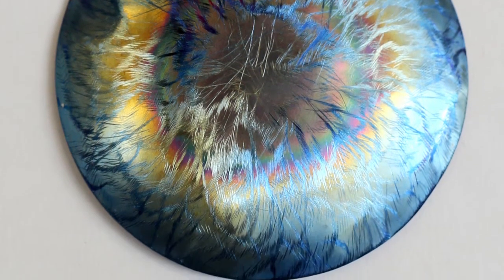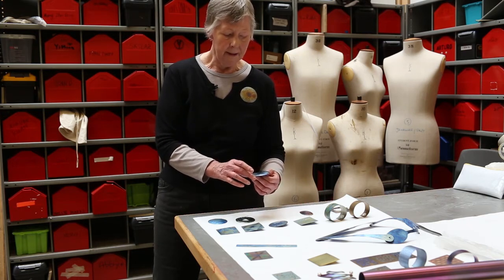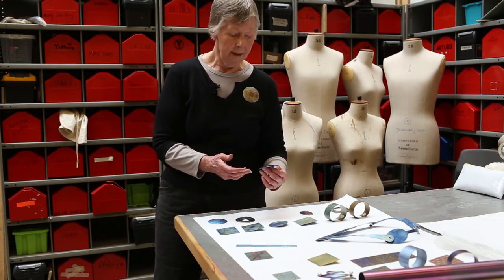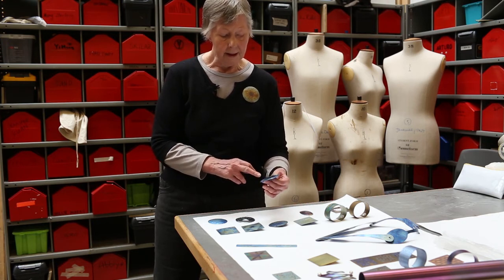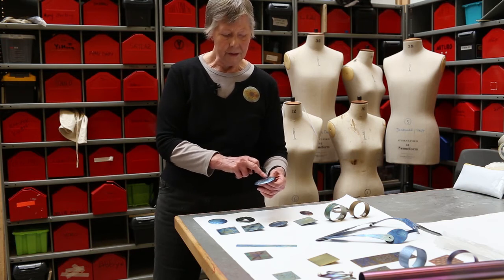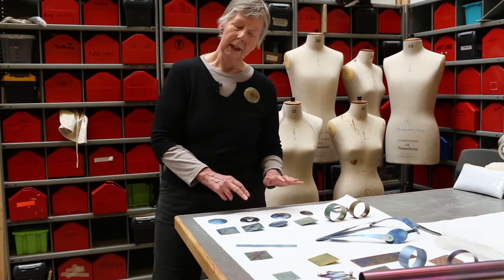I had to make a couple of brooches and I wanted to see what could be done, so in doming the piece — titanium is movable, it can be quite hard, but you can get a simple shape — then colouring by heat, trying to make sure there was a central circle by playing the flame carefully around the middle. That's just simple colouring and filing.